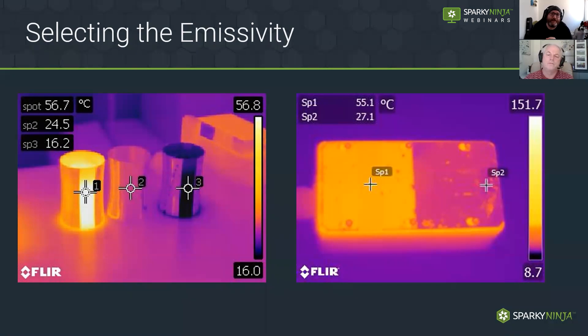This image on the right is an aluminium block that's been heated up — half of it has been painted with black enamel paint. The painted side shows a higher temperature because it's now a better emitter. The unpainted right-hand side is still shiny and reflective, though there are a couple of warmer spots where there are dinks, because the geometry there means the infrared radiation becomes a slightly better emitter. Companies like the Snell Group will show you that if you take radiators with nice shiny pipework, you're not getting a lot of radiated energy — but painted with matte black paint they become much better emitters.